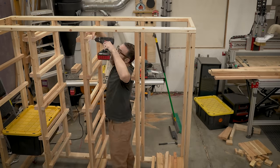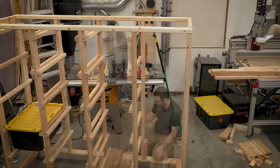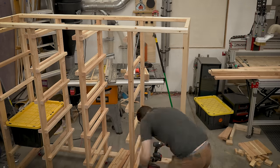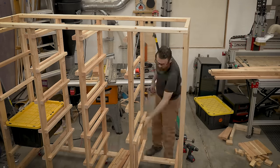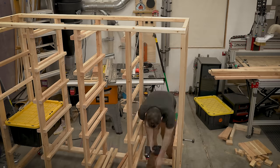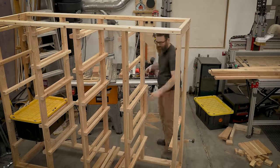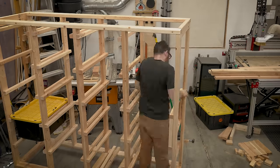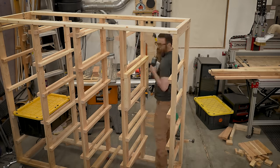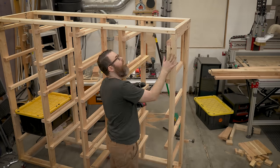Getting the rails on there was fairly straightforward. I always forget how terrible dealing with studs is — there are knots everywhere. I have to pre-drill everything because these are relatively thin pieces and I don't want them splitting. Overall it went pretty well — the spacers worked out just fine. I'm making sure I don't run two screws into each other from both sides, doing four screws per runner — two in front, two in back — and just staggering them. I looked at the other side to see where those were and staggered accordingly, and thankfully I didn't run into any screws.